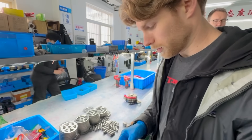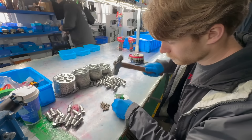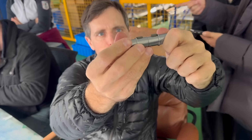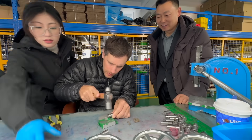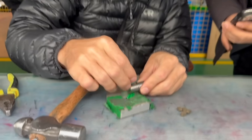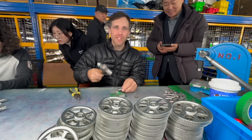When I say we are going to assemble things, it's not me and this puppy — I brought Chase, my engineer. About to install the flat key into the spindle. I gave the flat key a whack and it was still sticking up too much, then I found tiny taps were better than smashing it. Less muscle, more brain.